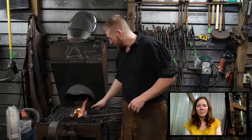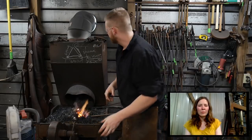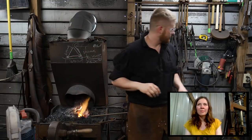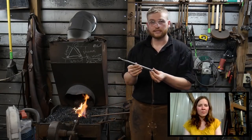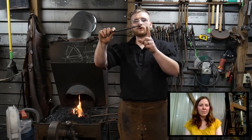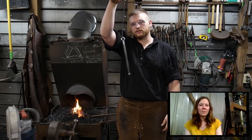On one of the 14 inch legs, we're going to draw out about a 4 inch long taper — or 100 mil. So we're going to pull out a 100 mil taper — that's the first thing we do. Then we will work at the clacker piece, which is the part you hit the bell with. That's made out of a piece of 5/8 inch round material — 16 mil round bar — that is 10 inches long or 250 mil. Then we're going to form a ball on one end and slit and drift the other end so we can put a bit of cordage through it to hang from the actual dinner bell.